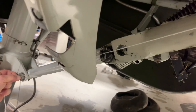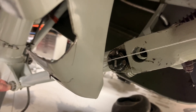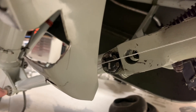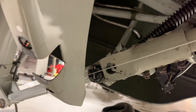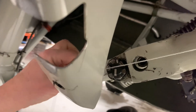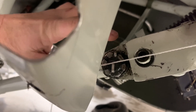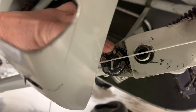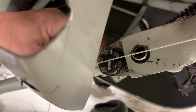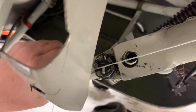Looking at this, I'm of the opinion that this thing is not far enough down. The string is passing below the one-eighth inch mark we have on the bolt, so I'm assuming there might not be enough droop in the landing gear here. I just wanted to confirm before I go do anything to it.